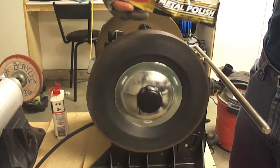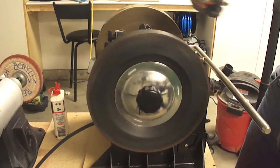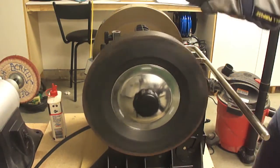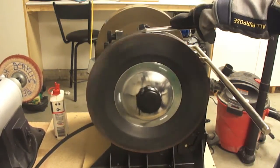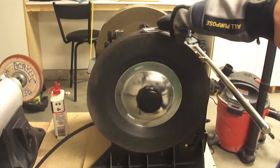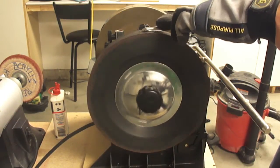The honing process will provide the tool a long lasting cutting edge. The movement is going to be the same as the previous movement on the grinding stone, concentrating the tool on the top contact point. As lubricant we are going to use a metal polisher. This will provide the shine and will eliminate all the scratches from the previous grinding process.